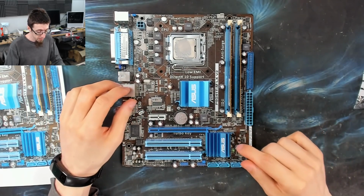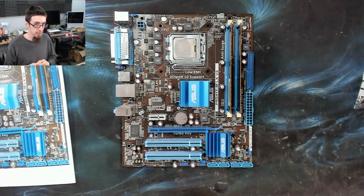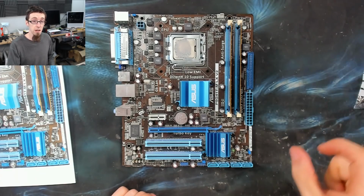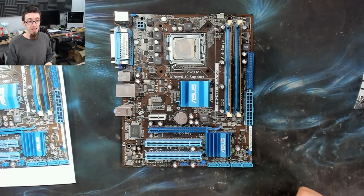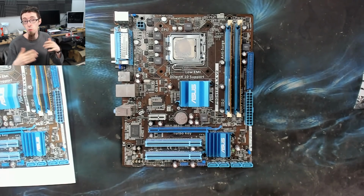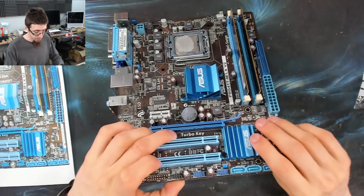There might not be. These capacitors might drop into a reader and they might look absolutely fine, especially because I don't exactly have precision instruments for testing capacitors. But, I don't know, we might look at it and go, hey, look, there we go. There's the numbers that are out of spec. So we've demonstrated in numbers what this failure looks like, whether that's a different ESR or a different capacitance or whatever. Right, so I shall switch on my soldering iron and I will take off a couple of caps, and we'll do some tests and go from there.